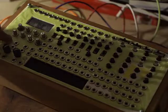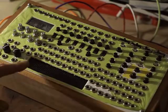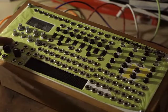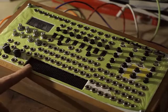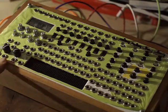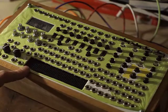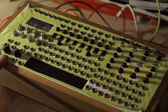The second section is a MIDI converter, MIDI to gate, 4 gate and 4 pitch converter, and a MIDI clock out. It also has a common section for the MIDI on the first 3 columns, and MIDI clock out, and also these 3 jacks here have a section for tip, ring and sleeve, so it's possible to get the clock out routed to the TRS section, and you get MIDI clock out.